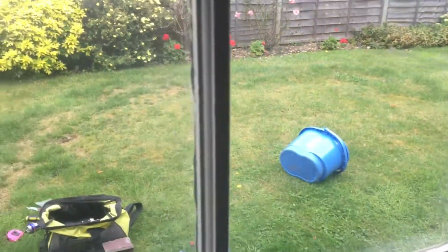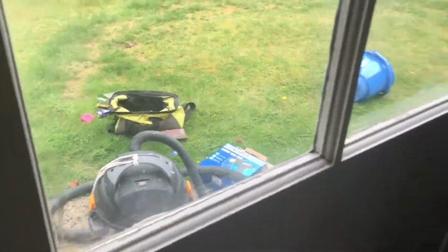I had to take a little bit off the edge of the door here. It was binding up at the top. Now it's not binding, so a little bit of filler in a couple of places on the back, around the joints, and basically not too bad down here. Just a little bit of scraping and cleaning with the sugar soap. So now I can get on with painting it.